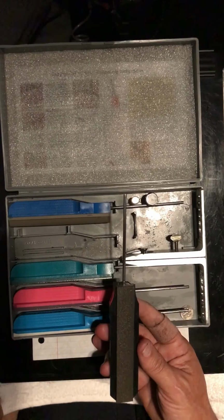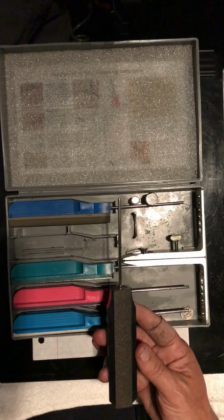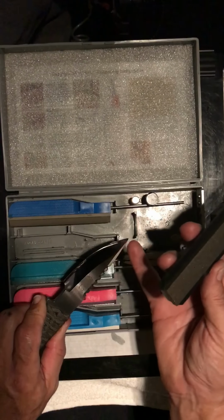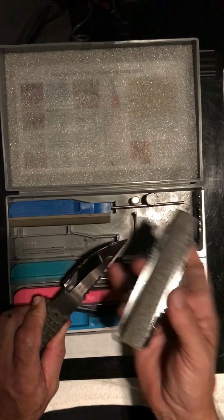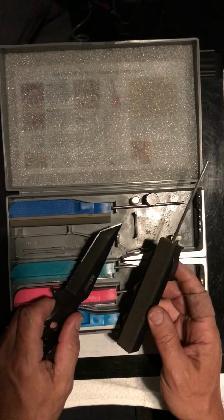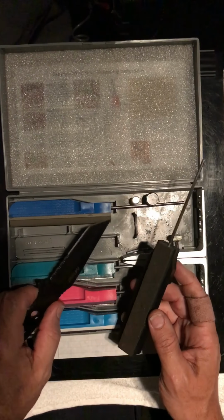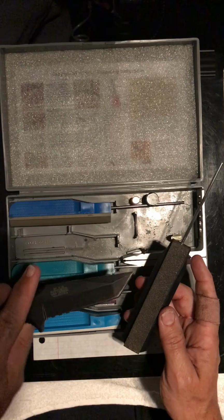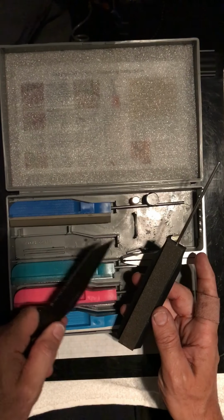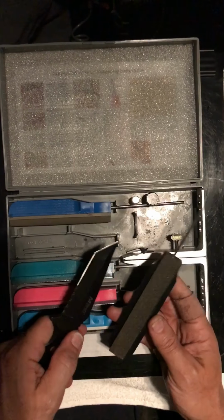You always start out with your coarse stone to set that initial facet. You can see here I've got one facet on the end, that long, curved, smooth, clean surface. That didn't used to be that way. It didn't used to be there at all. That knife originally looked like this. A small edge, way too steep, cut on a grinder. Probably messed up the temper and the grain in the metal because it was done at high speed, which overheated the metal, messed up the temper.